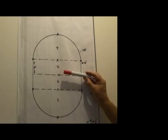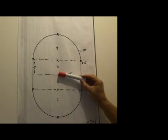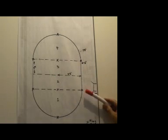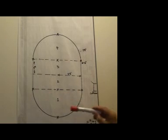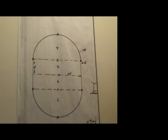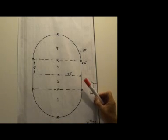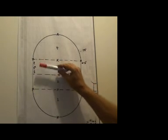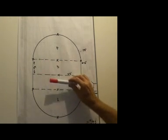The central pole doesn't have a surveyor's peg there, but you'll find that's where there was a big steel peg placed last year, so that's the centre pole. So having marked out the entire ground and put a red cross at every point where a tent peg goes, that makes it much easier for construction, and that can be done the day or 2 before the tent is erected. Overall dimensions, these central panels are 24 foot wide.